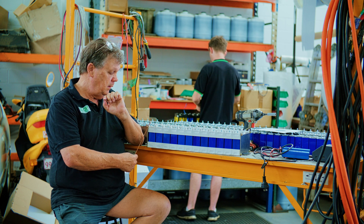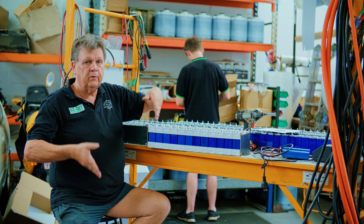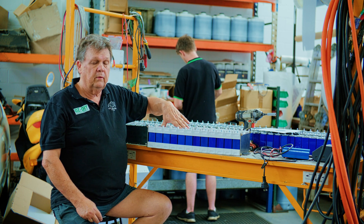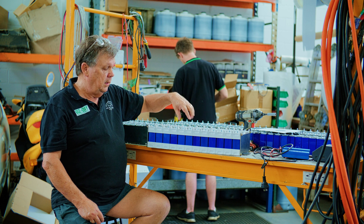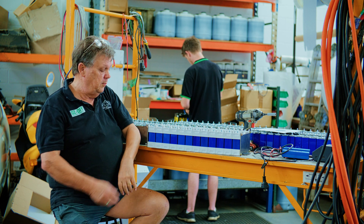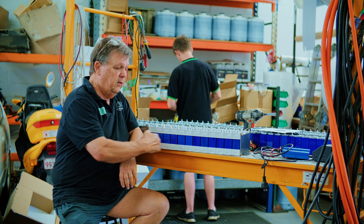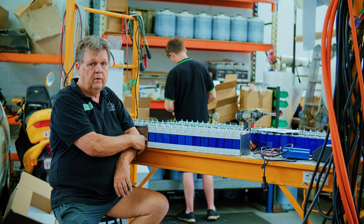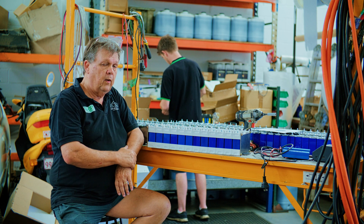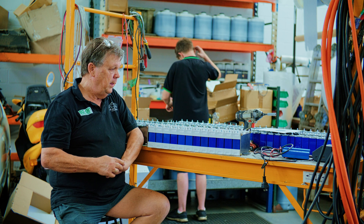That's our quick, easy, secure way of putting cells in cars — keeping them all separated and eliminating battery rash. Instead of placing individual cells into a box, you pick up the whole slab, drop it in, put two bolts in either end, and you're done. Put your interconnect bars on top, run your cell tap wiring for the BMS, and that saves so much time and looks neater. Your 20g impact rating is based on just the string secured to these plates, not the whole battery box, assuming it's properly mounted to the vehicle.